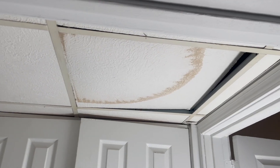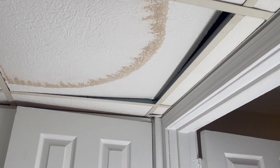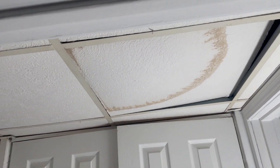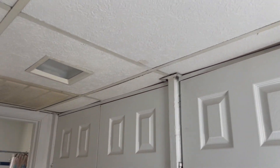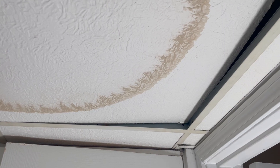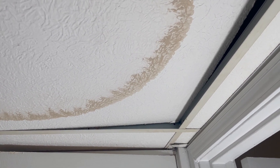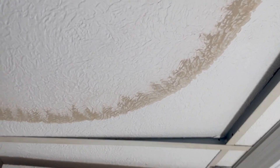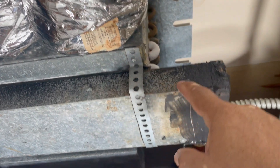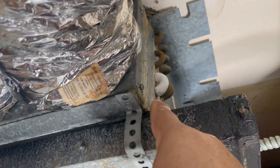We're hitting another service call — this is an air conditioner that is leaking. The evaporator is enclosed right here in the ceiling and we have the return right there, so we have to find out why the evaporator is leaking. It could be the tray, or it could be the unit itself, or it could be frozen. Let's remove this cover. This is my tray, my drain — look at that, the coils of the evaporator are starting to be frozen.